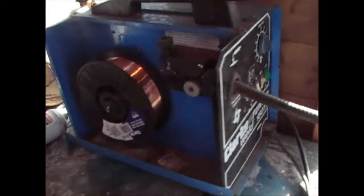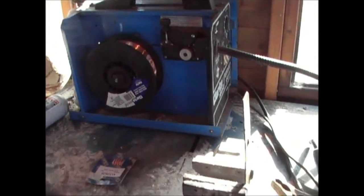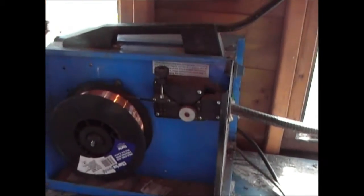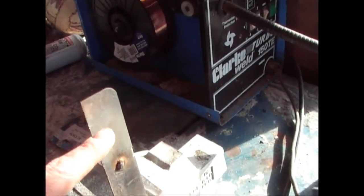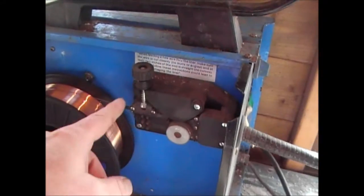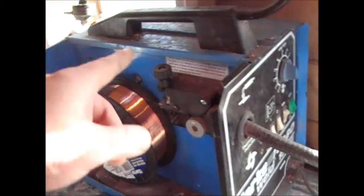Okay, those are pretty much the tips that you need to use a MIG welder. As I say, the diamond points, the bits that you really must do, is whatever you're welding must be clean. No paint, dirt, oil or anything like that. Obviously set up the wire feed and everything as I explained. Set up your gas exactly as I've explained.